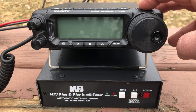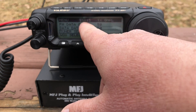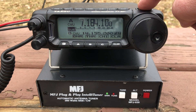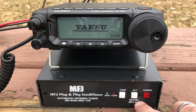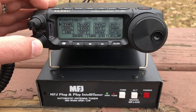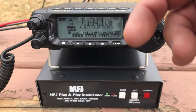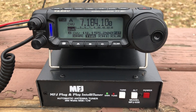There's one thing we've got to do before this will actually work. Turn the radio on, hold down the function button, go to menu 1615 where it says tuner select, and turn that to external. Get out of there and turn it off again. When we turn it back on, it's powering the tuner. Also go to function 1 to TNR and turn that on. I've assigned it to my B key to make it easier, so now when I hold down the B button it's going to kick this into gear, send out a carrier, and tune the antenna.